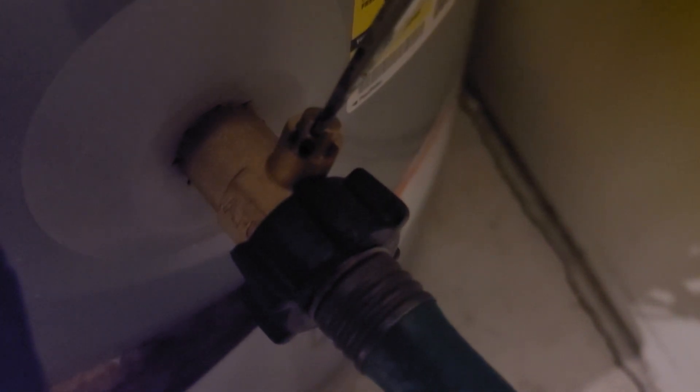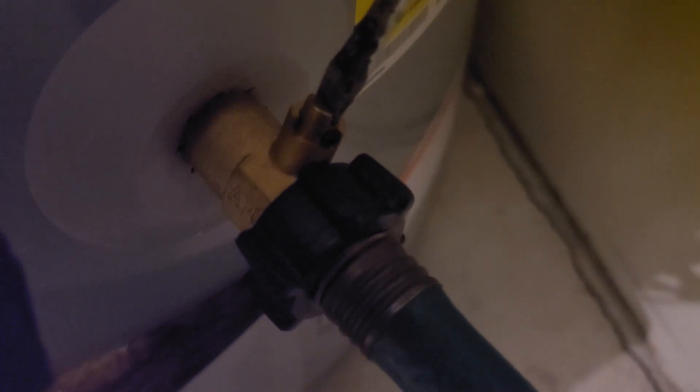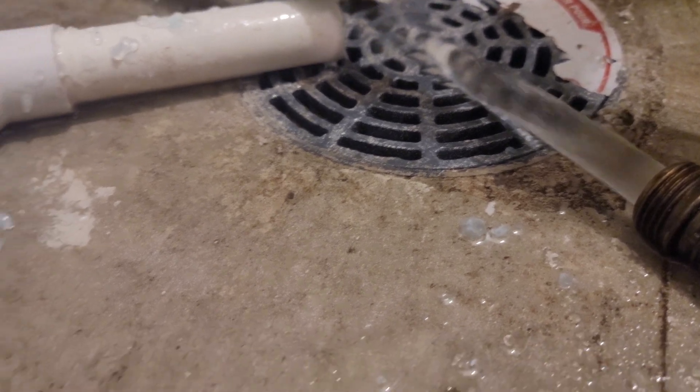Towards the top of the tank is a relief valve for preventing your water tank from exploding. Sometimes the tanks will not drain even with the drain valve fully open one quarter twist. If this is the case, then you will need to burp the water tank with the relief valve. There are several tutorials of this online.